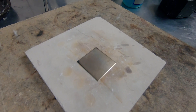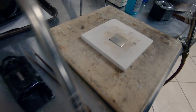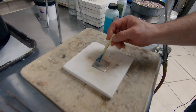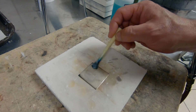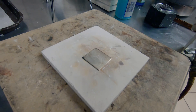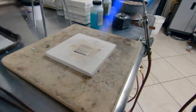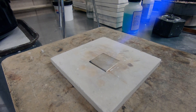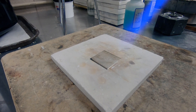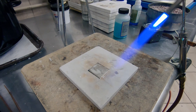So that was one way of annealing metal and knowing when your metal is annealed. Here's another way, and this way I use flux. I personally like using paste flux. I use paste flux on all base metals and sterling silver, but you can use liquid flux as well. Flux is a really good temperature indicator, and it really helps out whenever you are annealing. Let's go ahead and fire the torch up and start drying the flux out just a bit. Another thing is this will help fight oxides that are built whenever you are annealing.